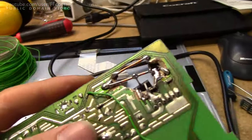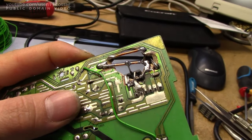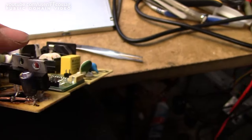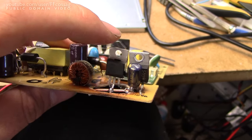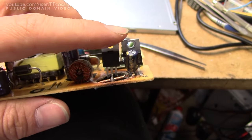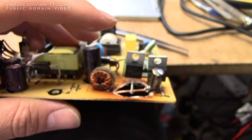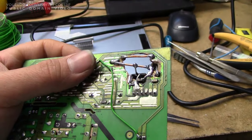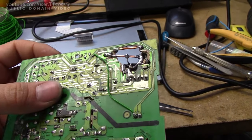I've just recreated the original wiring with some copper wire and put a couple of new devices in there. The only thing I'm not entirely certain of is if this rectified diode is the right way around, because the original one was shorted and it's not very clear from the markings how it was oriented. So I've got a 50-50 chance — or perhaps 70-30 since I went by logic. It looks the same as my old picture. I'm also patching up a broken trace.